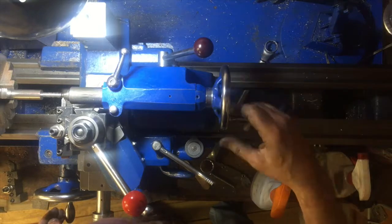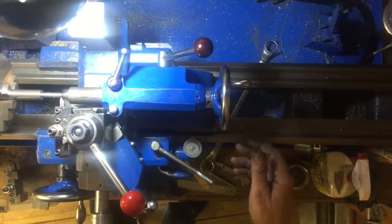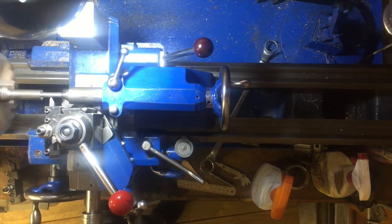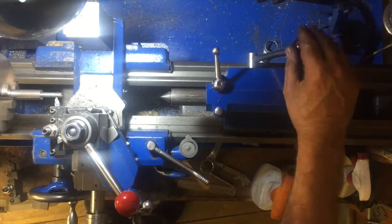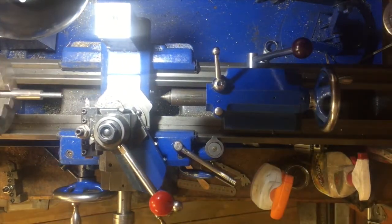There is a bit of spring in the material, and the tool will cause it to deflect a bit and chatter or vibrate on the material, causing a rough finish, so you can get a smoother finish by bringing the tailstock into play with the centre.